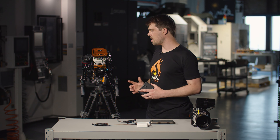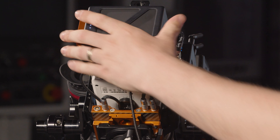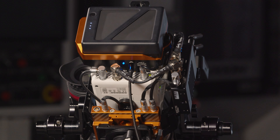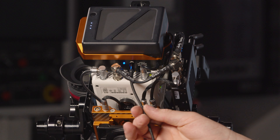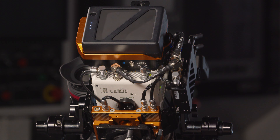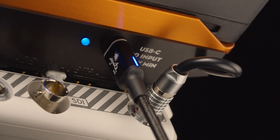Just make sure your focus puller isn't doing any focus pulls or anything like that that will have a large peak draw. Now I've got my fresh TB50 — line it up, slot it on, make sure the lights turn on. Give it four seconds to boot and then unplug your magnetic cable and then you've done a clean hot swap. An important note: the USB-C input does not charge the TB50 battery, but it does take priority over the TB50 battery when in use.